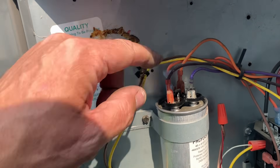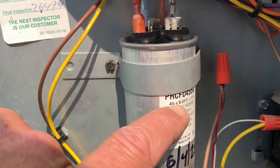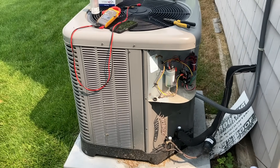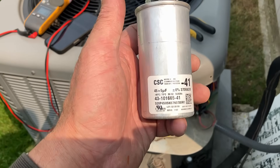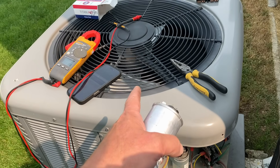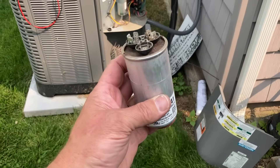My capacitor is reinstalled. I took the liberty of writing the date on the capacitor — 6/4/25 — and also made sure it's still visible without having to unsecure the capacitor, so the next tech who comes here knows what size it is. It's also a good habit to check that the compressor doesn't need a different capacitor size. Check your capacitor rating label and your condenser fan motor rating label to see what they require. We've been servicing this customer for a number of years — this was the original OEM that came with the unit. It's just time for it to go.